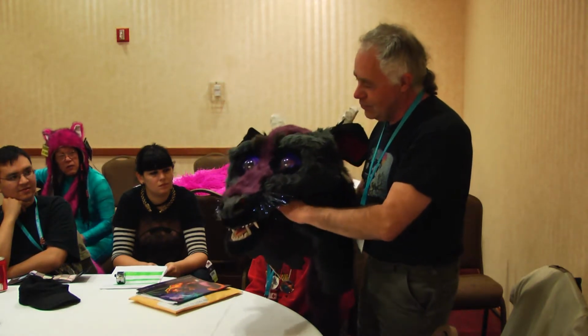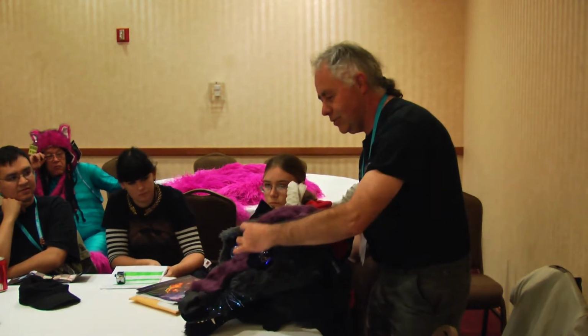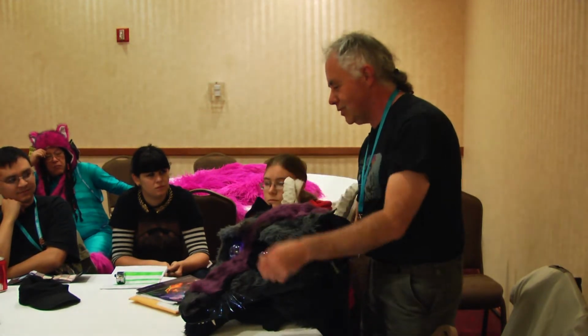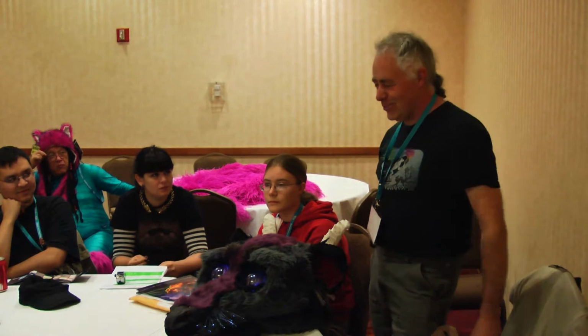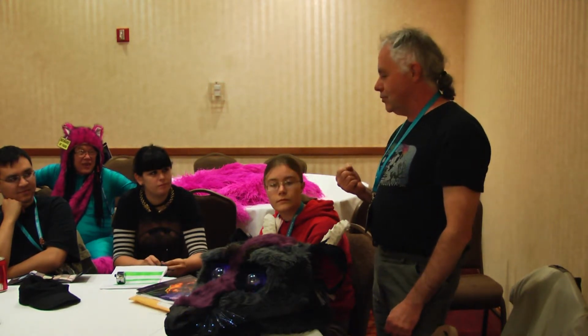He actually has a little servo for his irises that open and close. You can see he's got irises in his eyes, and there's a servo that narrows the eyes, so it sort of focuses in on something. And that thing is loud. It's really embarrassingly loud when you're on a panel and that happens. Everybody goes, what the heck was that? So that's another thing with servos: sometimes they're really noisy. The new digital servos you buy now are really nice, but they make a lot of noise. They're okay for the tail, but in the head you hear it twice as loud as everybody else does.